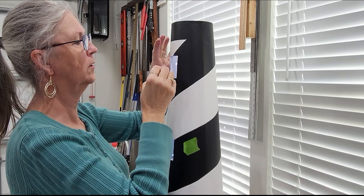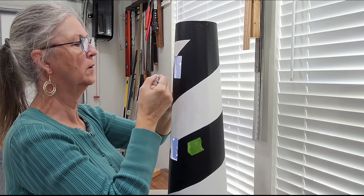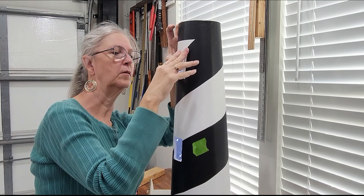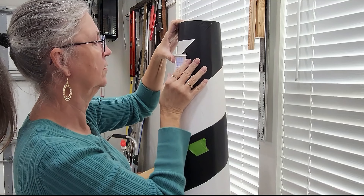The multiple coats of paint made the window openings tight in places so that the windows would not set flush, so what you're seeing me do is use a razor blade to peel back and peel off strips of the paint so that the windows are a good tight flush fit again.